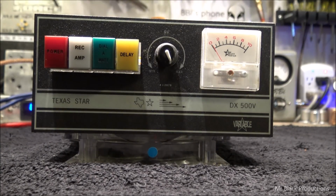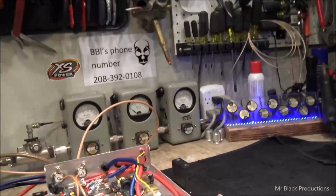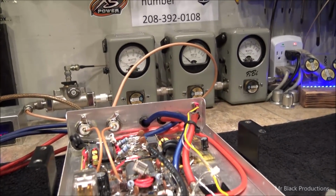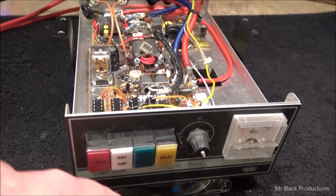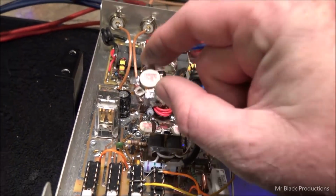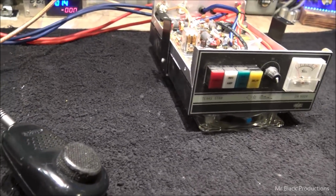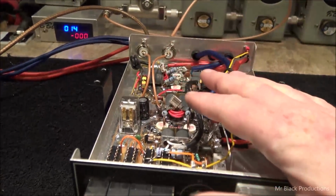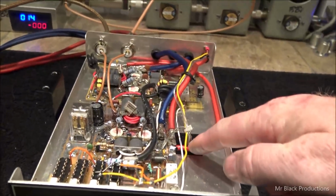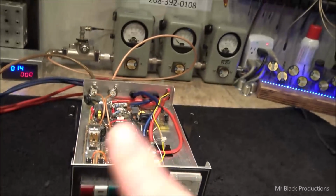So turn that radio off. Turn this one on. Okay, so we went in here and we pulled these 2 transistors out, and this one right here was bad, dead short. In the process we also had these little caps on the flyback resistors. I had a couple of them fail, so I put 103 disc capacitors in here, which will work just perfectly fine here, and here. And then we added this wire that comes across and goes around, and it ties the 2 boards together, so we don't have to worry about the 2 wires getting separated.